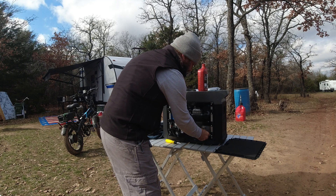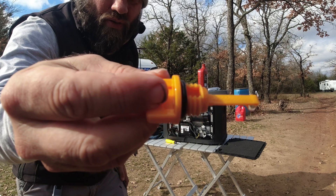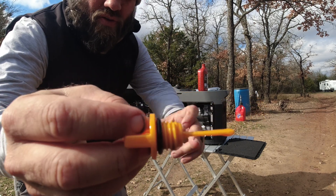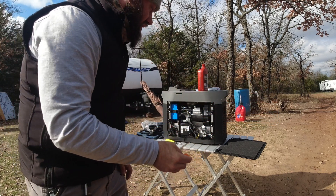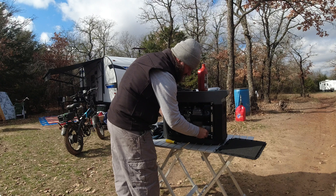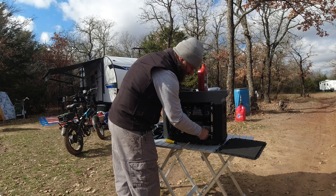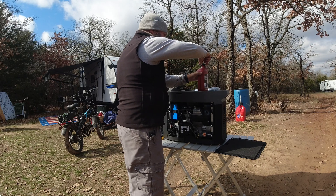All right, I got about six ounces in there, and that is just about perfect. The whole dipstick is a safe zone where the crisscross pattern is etched on it — not a very long dipstick, typical for a generator this size. So we're good there. It took about six ounces of oil.